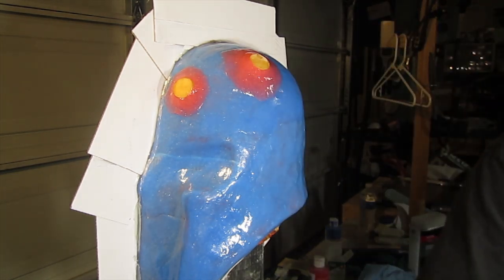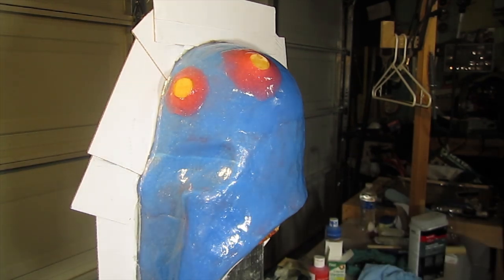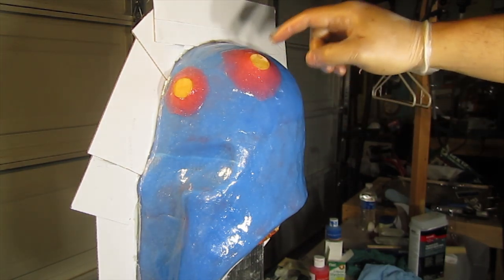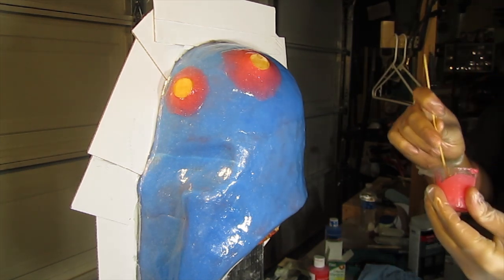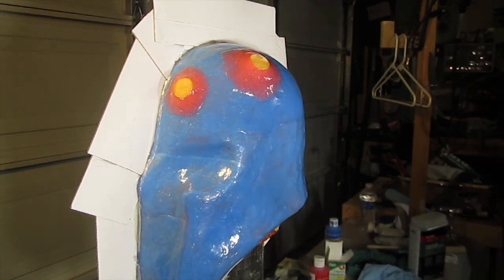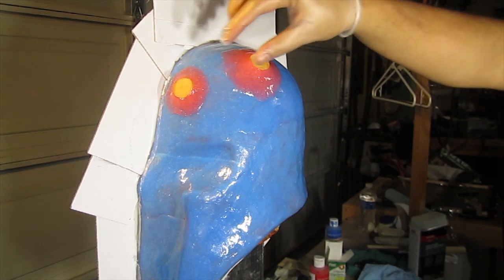Okay, here are some registration keys. What you do is you do your same mixture of silicone like we've done before. And then all we're going to do is start putting our little keys, or remember our slugs that we coated with fiberglass, in there and just spread the silicone out. I tend to use the 1 ounce mixture that we do. With that 1 ounce mixture, it allows me to do two keys.